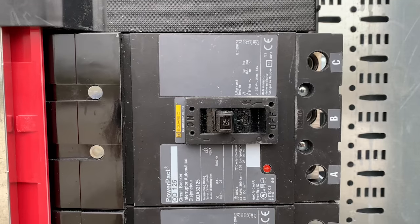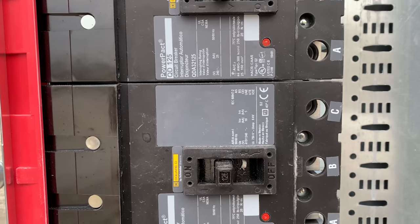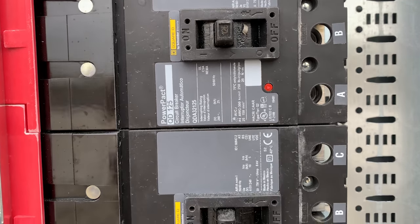So how does a circuit breaker work? There are a whole bunch of different types, and we'll get into that in a bit. But the average type you're going to see in a house or a business — a miniature circuit breaker, or MCB — is an inverse time breaker. The more current that goes through, the quicker it shuts off. These are typical breakers in homes. For massive custom homes you'll probably see MCCBs — molded case circuit breakers — which have some adjustability. But for typical houses, we're talking about thermomagnetic devices.